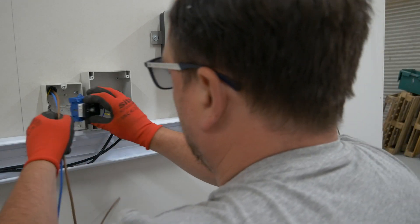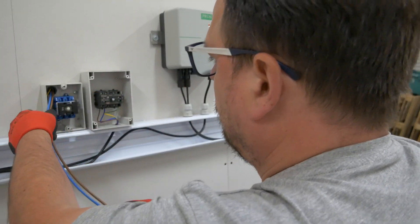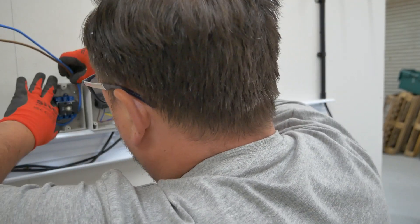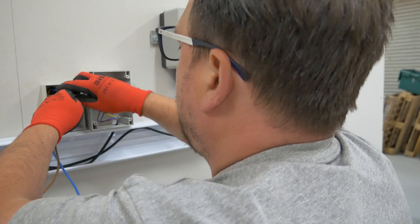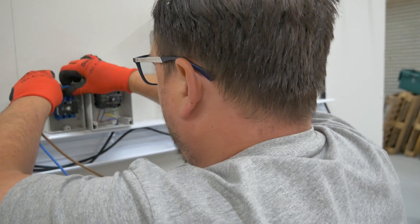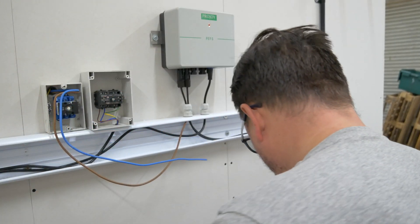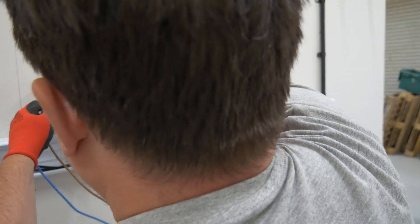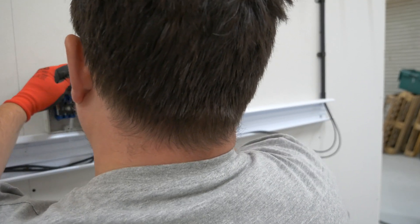These things are not the most installer-friendly products in my opinion. With this one we've popped the switching body into the isolator housing, and I was looking at bringing the cables all the way around and looping back into the top just to leave a bit of excess. But it really wasn't going to work based on some of the other wires coming through this isolator, so I decided to just double them back in the top and drop straight down into the input terminals. A point of note on these if you've never used them before: the T denotes the output side and the L denotes the input side. So you'll have L1, L2, and L3 typically with your neutral and your S, and then T1, T2, and T3. L is the input and T is the output.